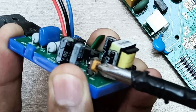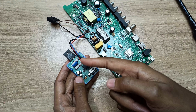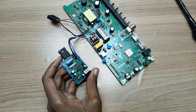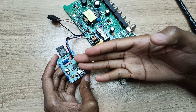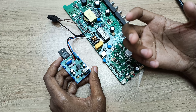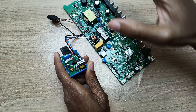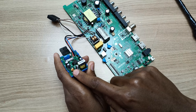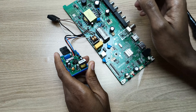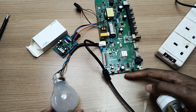As you can see, I have a short circuit on the primary side of this power supply. I suspect that this short circuit is being brought about by these four diodes. If you remember, instead of using two ampere diodes, I actually used one ampere diodes — and I was right.